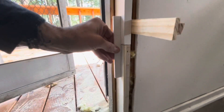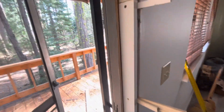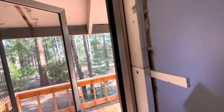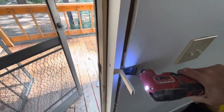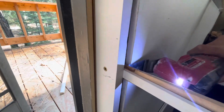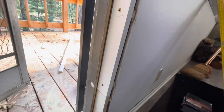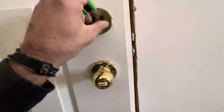Shim it out so it's a nice good match — that'll make it easier for you later. A couple shims. Zip these off with that oscillating tool again; love that thing, but it sure is noisy. So I filled those holes and seams with some putty.